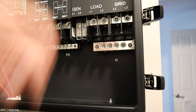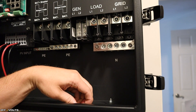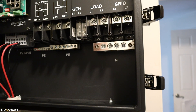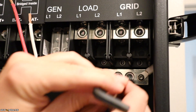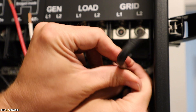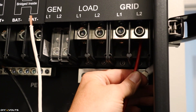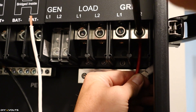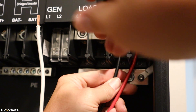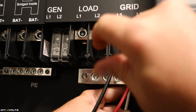I am going to be installing a grid to this inverter, so I'm going to take another one of these pipe glands and stick it down here in the bottom of the inverter case, then get my three different lines for the grid to go up into the bottom of the inverter. For the grid, load one and load two, and also the neutral, I'm going to use an Allen wrench to open those up to get the wire inside. On load one and load two I've got the red wire and the black wire — the color doesn't really matter as long as these make a good connection. The neutral is the white wire, and the white wire goes down here into the neutral. That takes care of the grid.